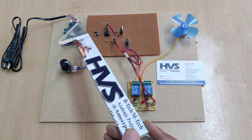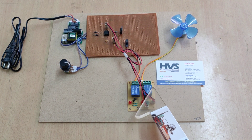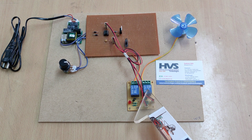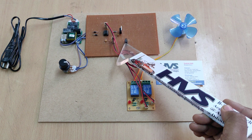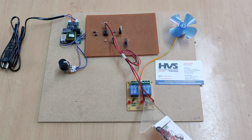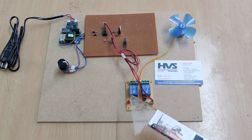We are providing dual inputs to this regulated power supply board, which provides a constant 5-volt supply sufficient to run the 555 timer along with the two relay boards. On this relay board, two transistors are used to control the two relays, which are 5-volt operated. These transistors receive trigger pulses from the slide switch — whenever we select the slide switch position, 5 volts is given as trigger voltage to the transistor, turning the relay on and defining the motor direction.